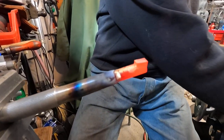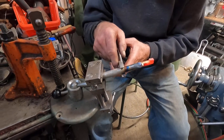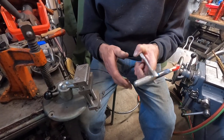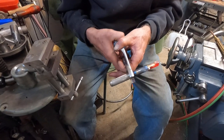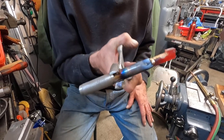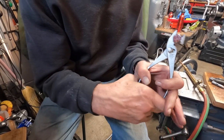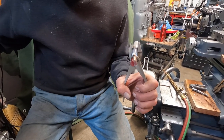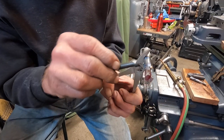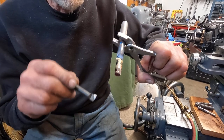It's a carbide blank. I'll grab this out of the vise with a pair of pliers because it's pretty darn hot. All I did was I turned this handle here, even put a little knurl on it, and I'm making a little scraper. I'll grind away the steel here and I can shape this so it is really kind of a petite tool, and you'll see me use it.